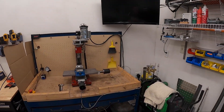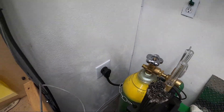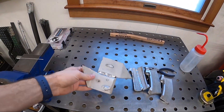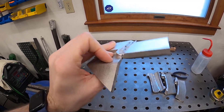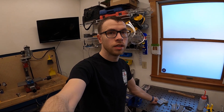One eternity later — back out in the garage again. Got some lighting upgrades done this past weekend, so that's sweet. Even more light to be able to see what I'm working on. More importantly, got a 220 outlet installed for the welder. I jumped right into doing some testing with some of the scrap that I wasn't able to weld before. Once I got a little bit of heat into it, it seemed to work pretty good. I'm thinking that 200 amps might be just enough.